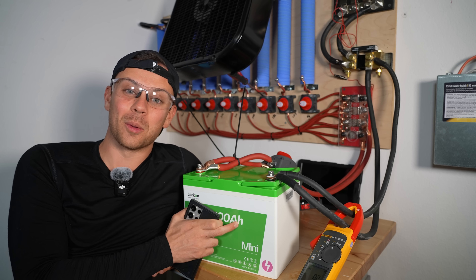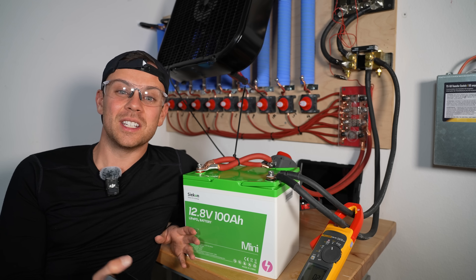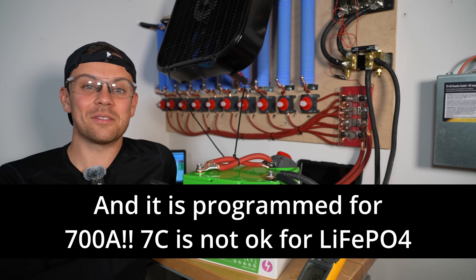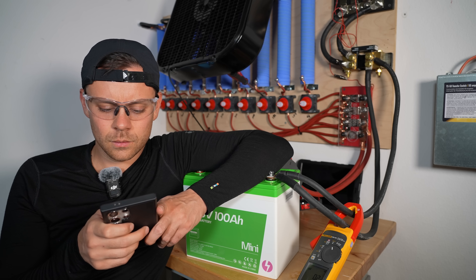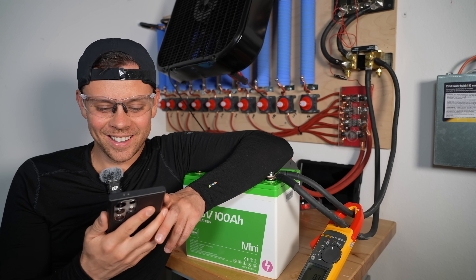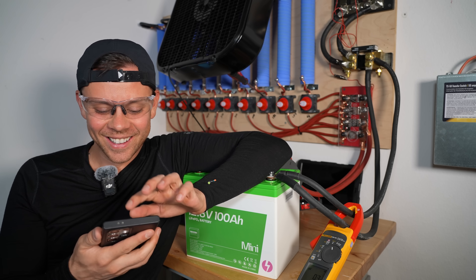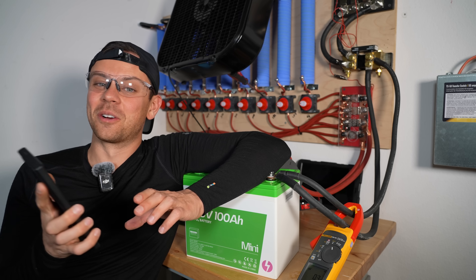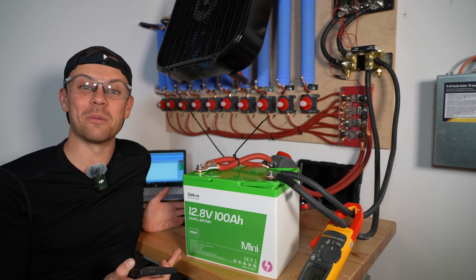It's not like other 12-volt batteries that have overcurrent protection built in. 500 amps on a 100 amp-hour battery is 5C — there aren't many lithium iron phosphate batteries rated for that. Typically at most you'll see 2C or maybe 3C. I would not push it to that limit ever again. Please add a fuse to this battery — that's not safe. I think their other battery actually powered my car lift, which is crazy. There's no overcurrent protection on the last test, so be careful. This thing needs a fuse.